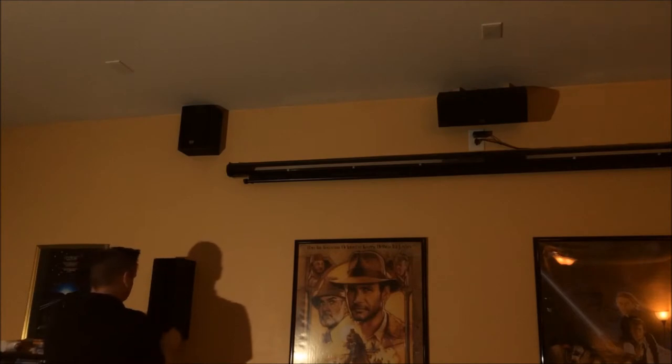Let's talk about the screen installation. All I did was run some 14-2 cable for a standard electrical installation up to a switch and then up to an outlet I installed right up here towards the ceiling, just above the screen. The purpose of this switch is that sometimes these electric automated screens can receive stray signals from the neighborhood — it was like we had a ghost. I'd come out some mornings and find this screen sitting down. I didn't like that, so I installed a simple rocker switch right here to turn the outlet on and off.